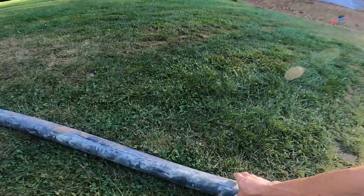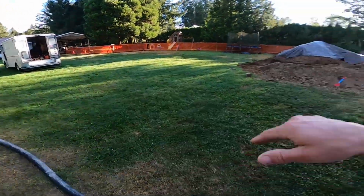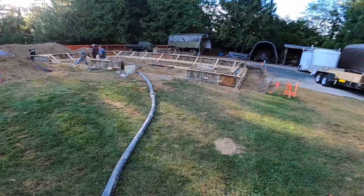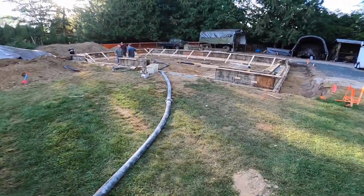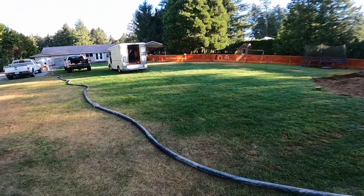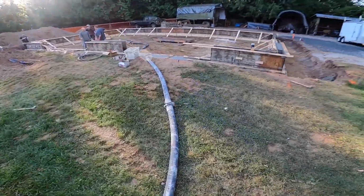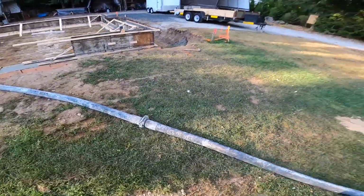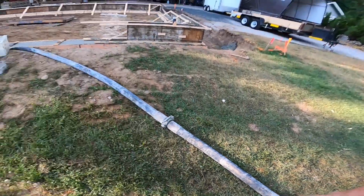Okay. Sometimes you'll get that. You'll get concrete, air, concrete when you're on a steep grade and the concrete is actually running ahead of the sponge. But on the flat like this is making me suspicious that there were a couple of strokes of air pulled into that hopper at some point. No big deal. Yeah, it's picking up now. Pace is picking up now.